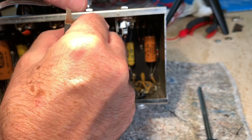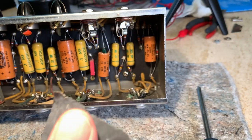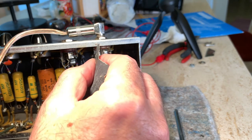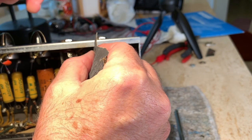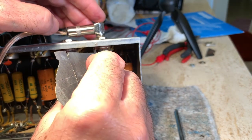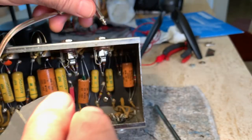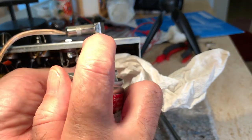I'm gonna run this in there. So I stick it in there while it's open, then I pull the plug out and pull the paper out, and that kind of just cleans that contact. Let's do it again. We'll do it on this one. Spread it apart. Go this direction and clean that side. Pull it out. Pull the sandpaper out, put it back in, turn this over, pull the plug out, whoop, darn it, lost my sandpaper. There you go, that'll clean those contacts out. Pretty oily right now, spray it one more time.